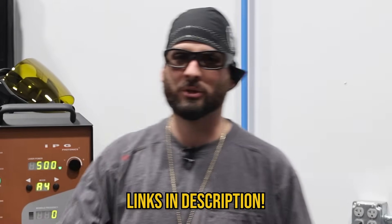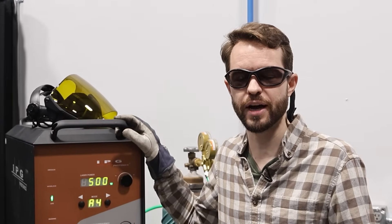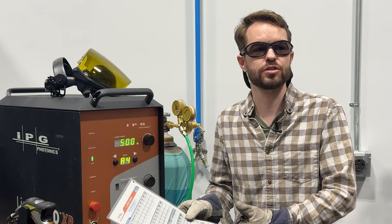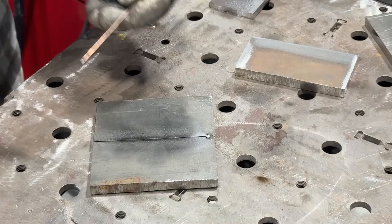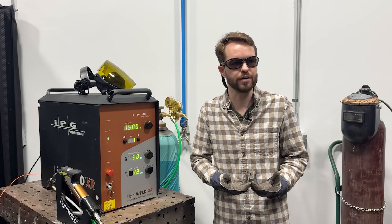Always make sure you're laser safe — there are courses you can take on laser safety, link down below. We are here with our IPG LightWeld XR1500 and we're going to dial in our parameters for the fillet weld and butt weld. IPG has great process guides and cheat sheets showing you what powers, programs, and preset values to use out of the box. What we're doing today is actually dialing in those parameters a little deeper. In user mode you can store up to 26 different programs — I've got a tack mode and a fillet weld programmed in, and we'll probably use that fillet weld program for the butt weld as well since we're focused on maximum depth of penetration.